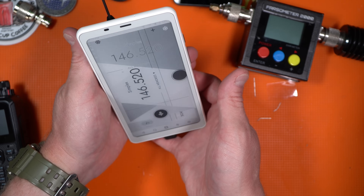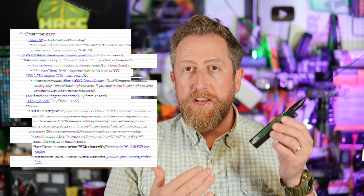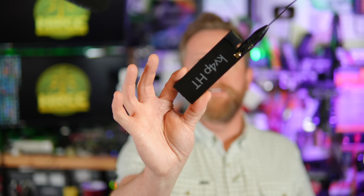This is a fairly non-standard kit in that you have to buy individual components and a specialized PCB. Soldering is very straightforward — even though the large board is surface mount, you just use a pencil soldering iron, tap a bit of solder on one side to line it up, then fill the rest of the slots. At $35 this is a really fun little experiment that works perfectly well. One watt isn't a lot of power, but for playing around and doing what this does — a fantastic entry into kit building and open source software development for radios — it's really fun. Go check out the KV4P; the link is in the description. Drop me a comment, give a like and subscribe. I'm Josh, KI6NAZ — 73.